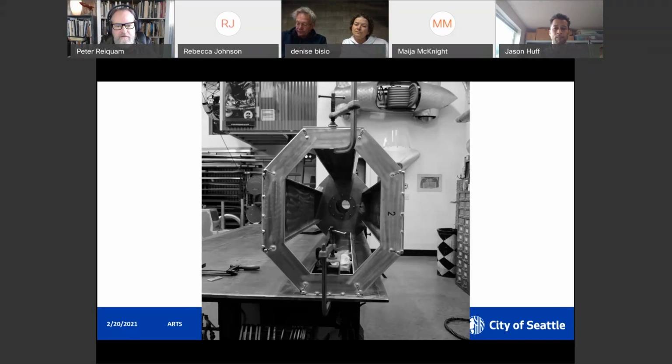So you can see now there's a lot of different parts to this, and there's a structure to it. The majority of these pieces, all the skin of this, we're looking at the one end of the hammer handle. The skin is made out of 3/16 aluminum plate, and these structural ribs are also 3/16. Next slide, please.